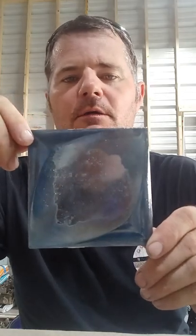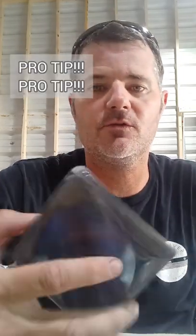Obviously the homeowner rejected the job and I didn't know what I was going to do or how to fix this. So I reached out to the tile manufacturer and I reached out to the adhesive representative. Now here's something that a lot of you may not know. When you're dealing with glass tiles, a really expensive product, check out the website, because they have a list of approved mortars that you can use with their product. Thankfully, I used one of the approved mortars.